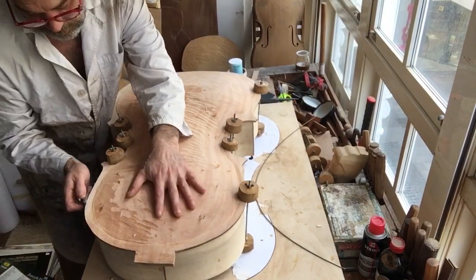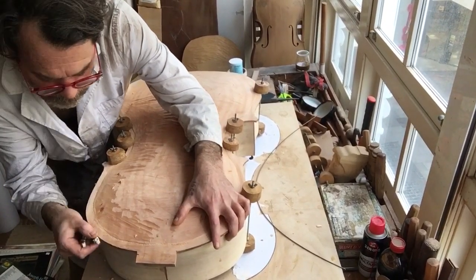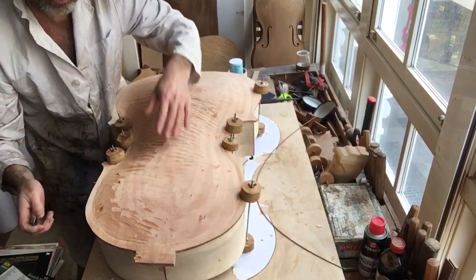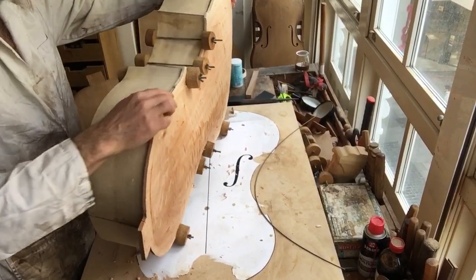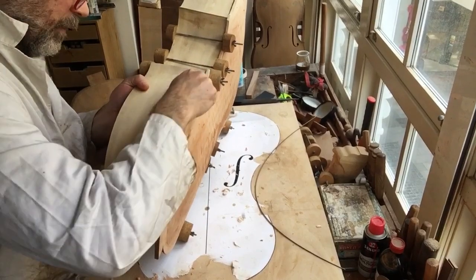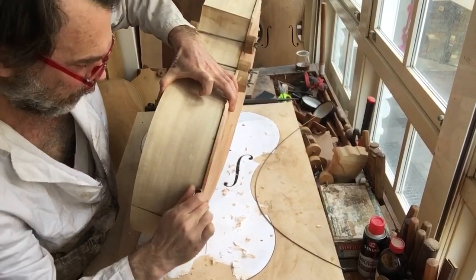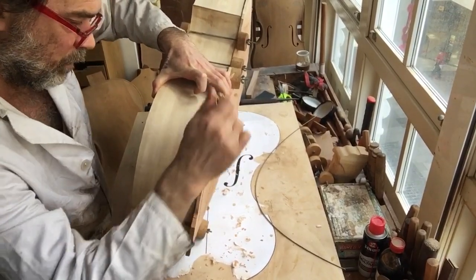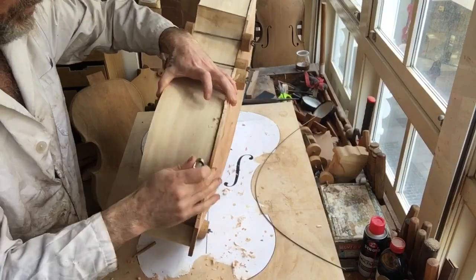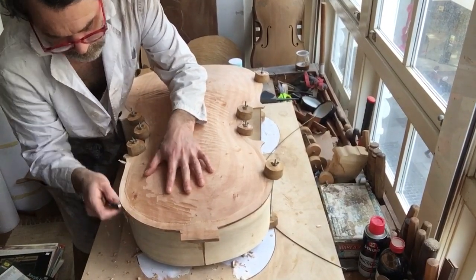You're just taking your plane and making a nice smooth line. When you get to here, the grain will change and you have no choice but to use the file. You can see I'm getting some chatter — chatter is when the plane skips because the grain is changing — so then I'll switch techniques.